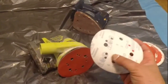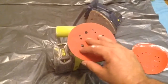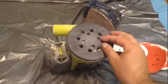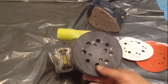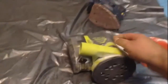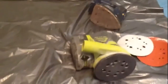It comes with these pre-perforated holes, which when you mount it on the pad, you see will correspond with some holes in the pad. See where this goes. And it's Velcro and it's kind of a wear item, but you go through these holes in the pad, and what that does is that helps it access the impeller action, which works off the same motor that's in the tool to vacuum sawdust partially through this thing and blow it out this way.